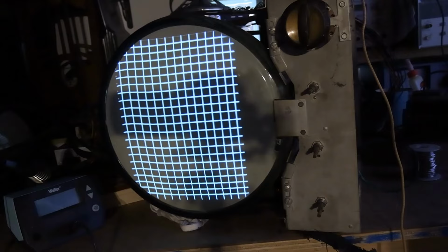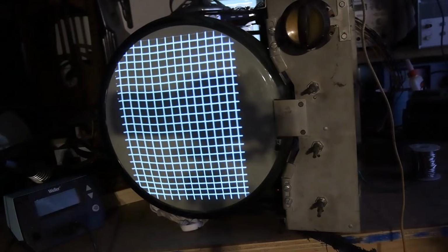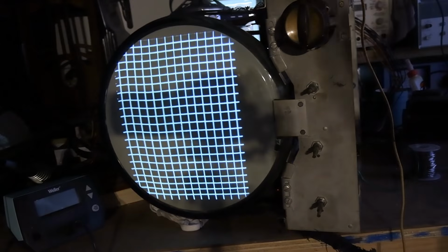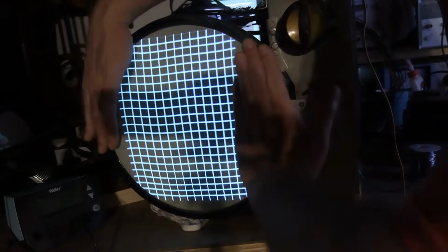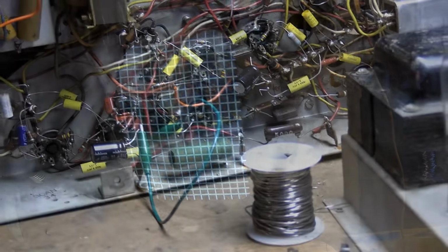There's porthole TVs, in which case the whole screen should be filled. There are rectangular masks, which tend to be the earlier sets, where it's a rectangle over this, and it shouldn't be full width, and it shouldn't be full height. And then there's the double D, when the marketing folks got involved and they wanted to maximize the screen viewing area, while still being honest, so they do block out the top and the bottom, but the width goes all the way to the edges. I myself don't remember what flavor this set is. I need to go look.